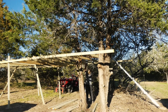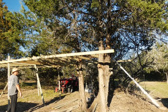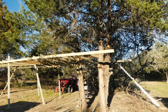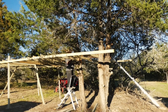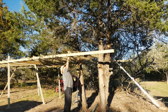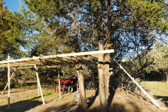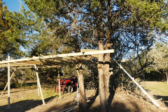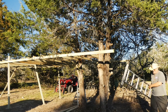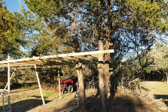Once I have the bottom truss on, I can go back in and put in the top pieces. I cross them over and lag bolt them all in, and boy does it draw tight. I'm watching the video while I narrate and I see wind in the trees but I don't see the building moving much, and I haven't even thinned the top part. I think my idea of building around a living tree is going to be safe and fine for this particular construction.